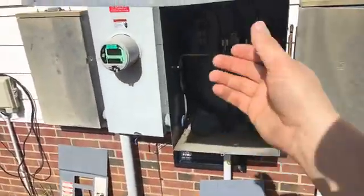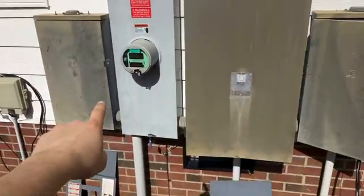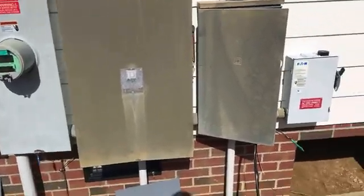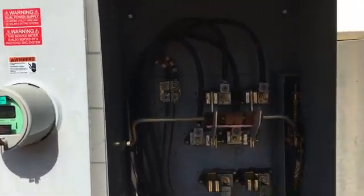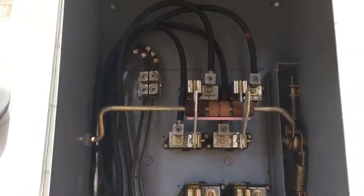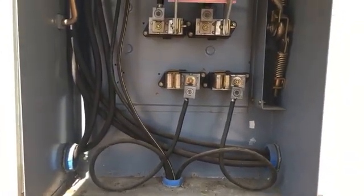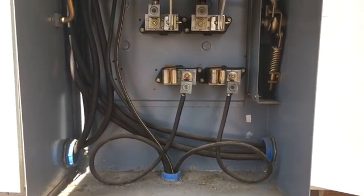All this equipment is open — this is his transfer switch. It's a cascading power system: he's got grid power here, and then he's got generator power if he wants it. That's what a transfer switch looks like. Those are the grid conductors — the transfer switch is making the grid connection right now. These smaller conductors are for the generator, so if he hooks the generator up and makes this side of the transfer switch hot, he can throw that switch.